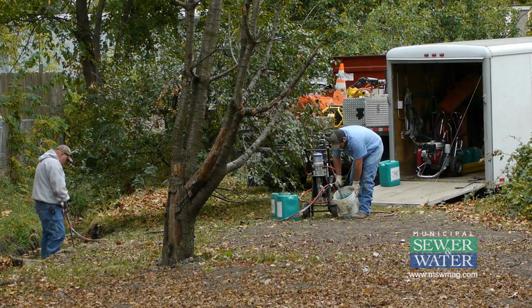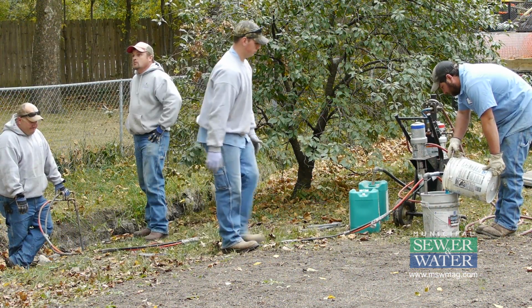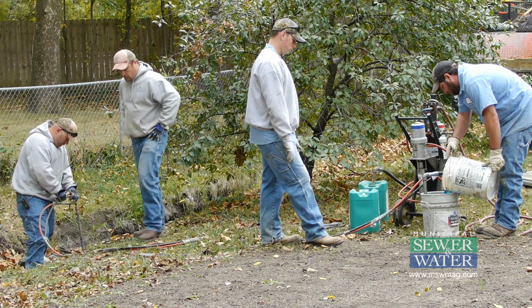We use a chemical grout that's either hydrophobic or hydrophilic, which means it reacts to the water, and it's kind of like your insulation foam but with a lot denser properties. Doing that, we put a TV camera in the line. We inject dye water down through the ground, what we call probe grouting. It's some new innovation that we've been working on with Prime Resin.